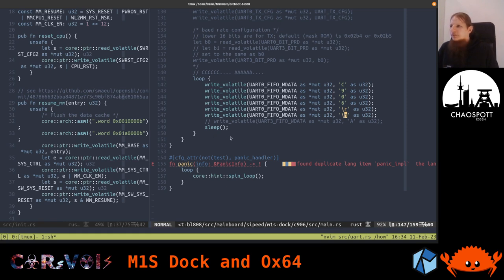The thing is, with the current code, we can only use the built-in SRAM. But there is also 64 megabytes of DRAM available, which is not exactly DRAM. It is DRAM behind the scenes, but it's called PSRAM, that is pseudo SRAM. That means it's actually backed by DRAM, but there is a very simple, lightweight controller. It's a bit weird to explain. Actually, I haven't really worked with that myself before, so I'm just picking up information other people told me.